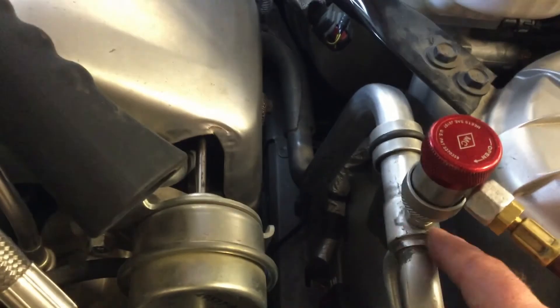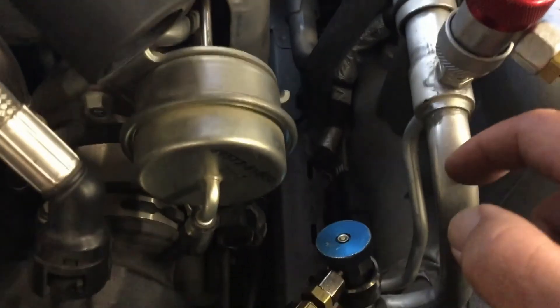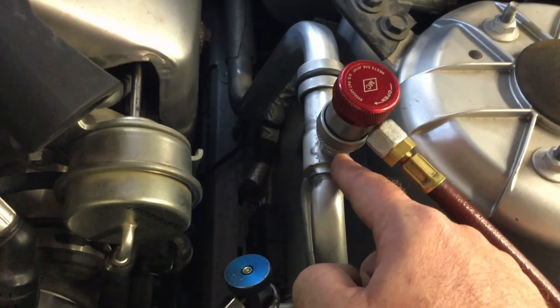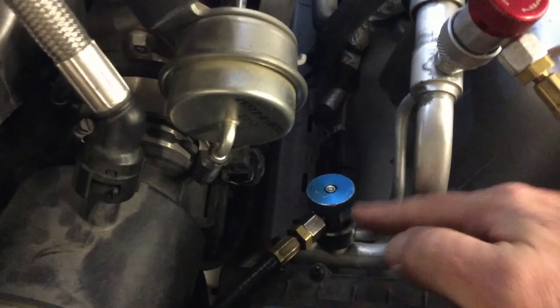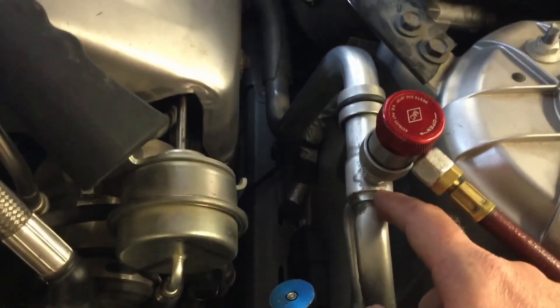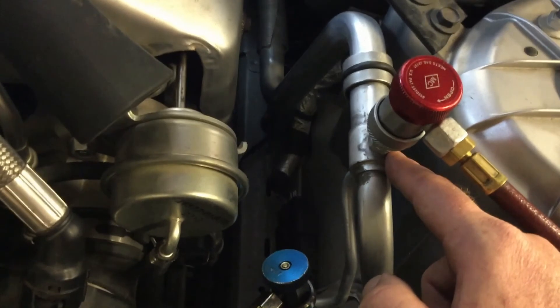The high side liquid line is on the outside of that tube and the suction line is on the inside. You can see where they connect again, with the liquid lines and suction line visible at the service fittings. The high side service fitting measures pressure as refrigerant is going into the heat exchanger — at the very beginning — so you would not expect to see any major pressure differences there. The low side service fitting comes after the heat exchanger, so the low pressure vapor coming out of the TXV travels all the way through the heat exchanger, being warmed up by the liquid line warm refrigerant. We would expect the low side pressure to be probably higher than normal, around 30 rather than 25.